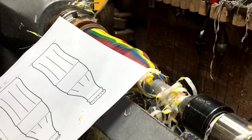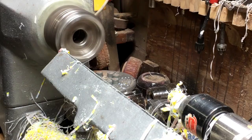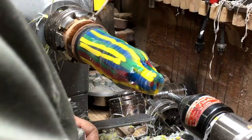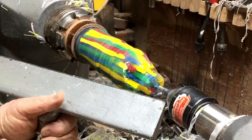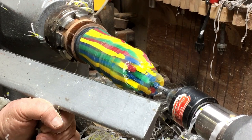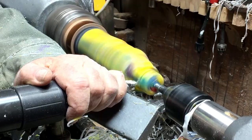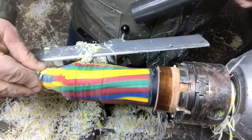Watch this carefully — the support I had on the tailstock was quite thin and it broke off, just broke off, and hit my fingers, but nothing major. The marks of the neck are still there so it's okay. It took me more than a little bit of time to bring it back into center. You can see there are pieces broken, but luckily they are on the side of the neck so I'll machine it out. I just have to be very careful where it broke off so I don't get a catch, because if I do it will break into pieces altogether.